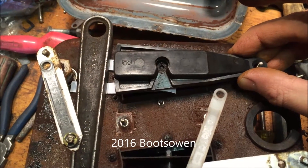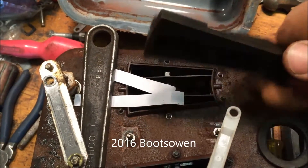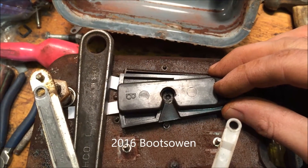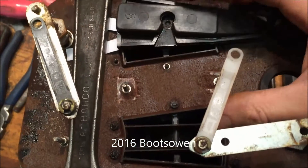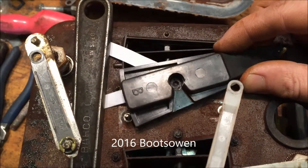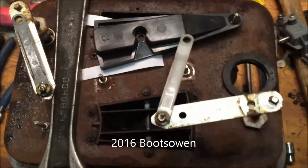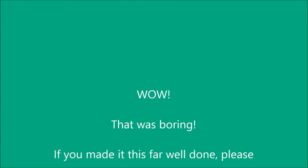Here's the cover that covers the top. It goes over one way, and while it's over that way, the chamber on the inside allows the gas from one side of the bellows to go out the exhaust, while this side fills. As it moves across, one side is partially filling and emptying and the opposite is happening on the other side — but offset by a small amount, so the whole system is constantly in motion. By having the system constantly in motion, it can never get stuck, so it will always restart. That's all done by the pressure of the gas flowing through the chambers to give a meter reading.